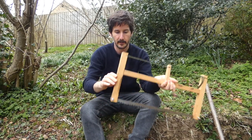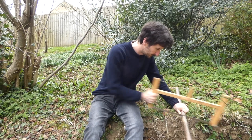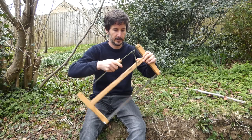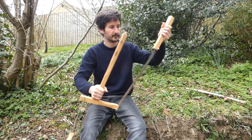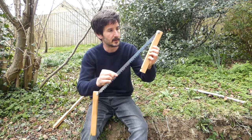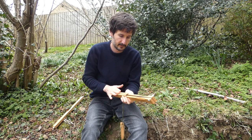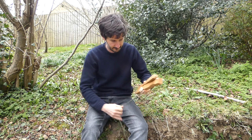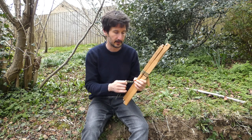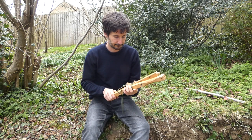The blade's nice and tight and I've carved the handle here so it's quite comfortable to hold. Then you take it down again — just release the tension in the cord, hook that, and pull the cross piece out. It goes teeth first into these grooves on either handle, that way you aren't going to hurt yourself on the blade. Put those together and hold it like that — so you can keep it as basically two sticks and a bit of string. Stick it in your backpack or put it somewhere out of the way so it's not taking up loads of space.